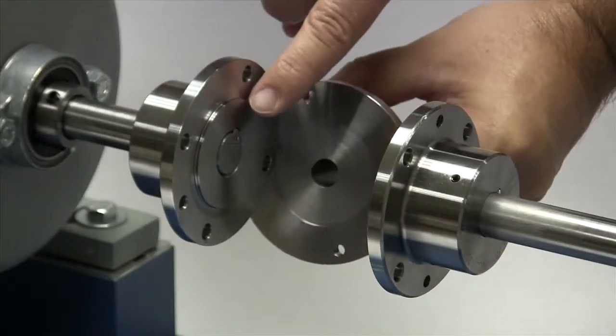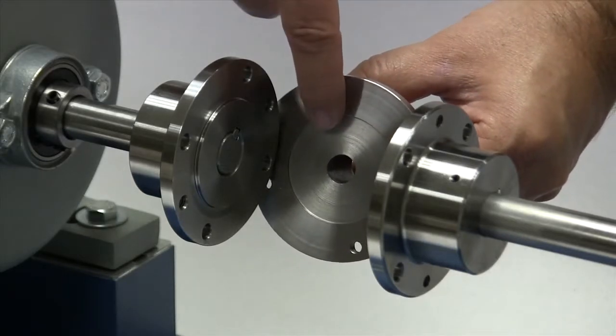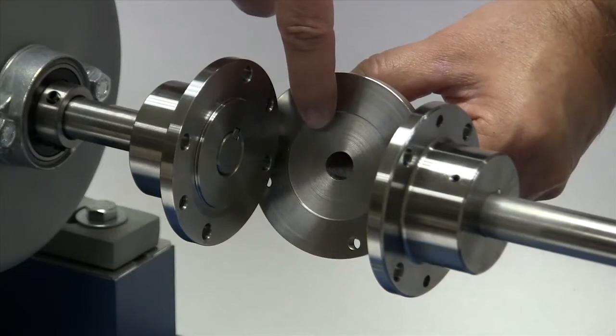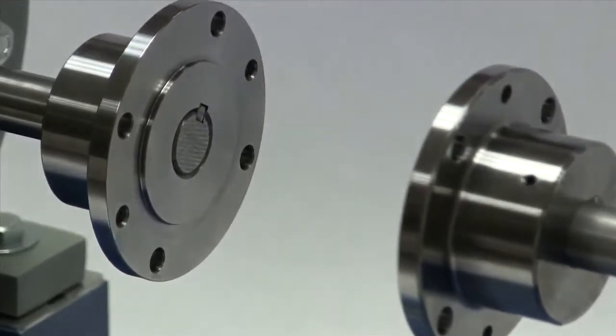The spacer hubs have a slight pilot surface sticking out from the face of the hub. This pilot is designed to help maintain concentricity with the spacer assembly and will fit snugly into the mating pilot or recess in the spacer assembly. When installing the hub, line up this pilot surface with the end of the shaft and the key.